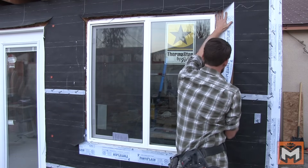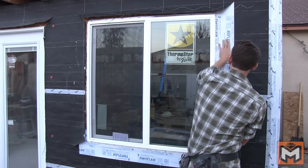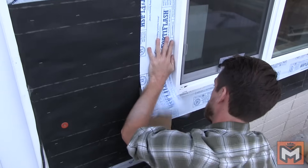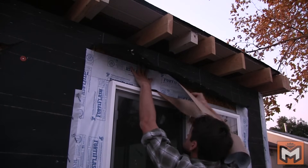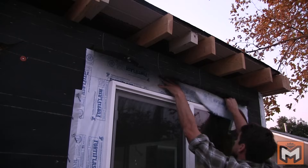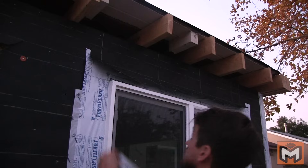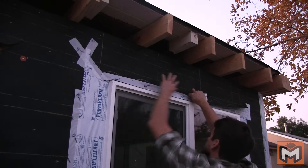I'm taking another piece of rolled flashing and securing it over the top of the window flange to the OSB sheathing and to the house wrap, making sure to tuck it up underneath the top flap and over the bottom piece of flashing. I do this on both sides. Once the sides are complete, I attach the top piece of flashing, installing it underneath the top flap and directly to the sheathing and over our nailing flange, so any water that gets onto the house wrap above the window sheds off down the sides. Lastly, I use house wrap tape to tape the diagonal cuts that aren't covered by the flashing, and I tape the top flap above the window as well. Sometimes I also tape the edges of the flashing down to make sure it holds nice and tight.